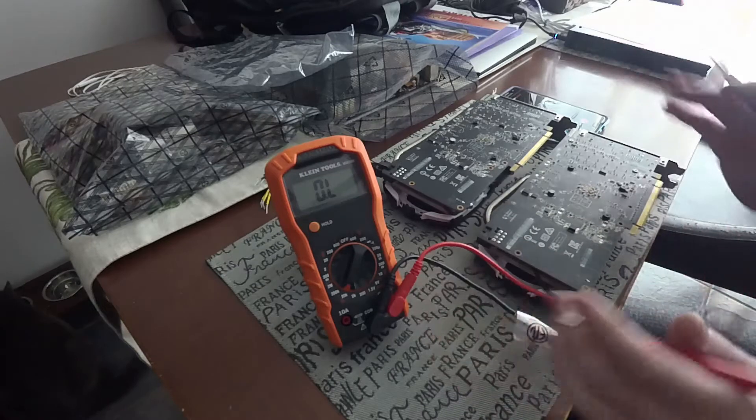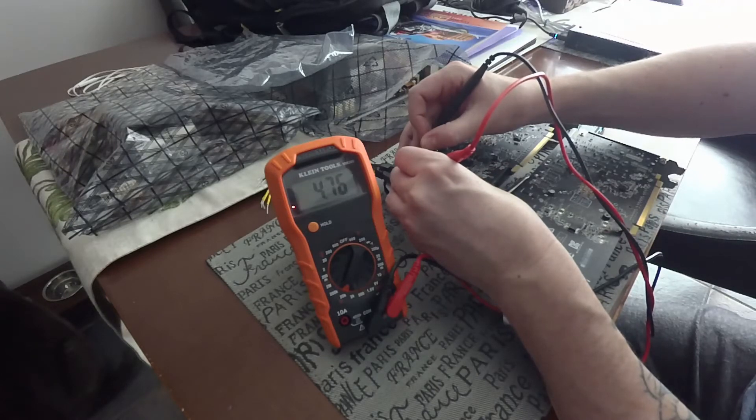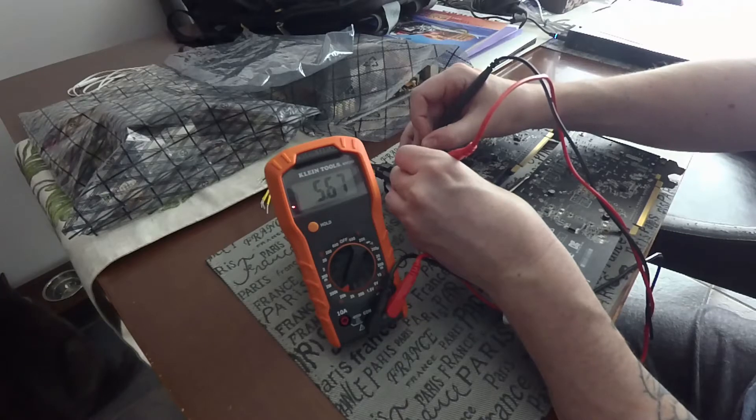On the working card, I'm measuring between the negative and the yellow wires, which is the positive. You can see the resistance on the meter increasing — this is in K, so it's at 5K right now and increasing. It's going to go up to about 6K and hold around 6 to 6.2K. On the good card, it's around 5.7K, slowing down like it's charging up a bit.